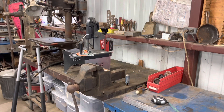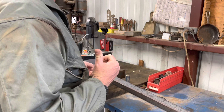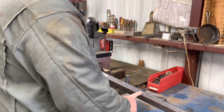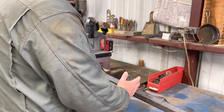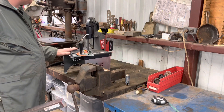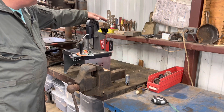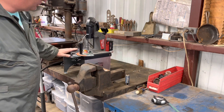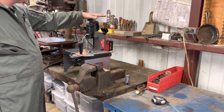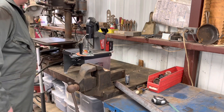To make my shelf, I need to cut the angle iron at 13 inches, because it's a 13-inch toolbox with a 2-inch angle iron on the trailer I'm going to weld into. That will give me 11 inches underneath the toolbox. To cut it, I'm going to use one of the best tools I have — this is a Milwaukee Fuel M18 cordless portable bandsaw. This mount is by Swag, S-W-A-G, and it's made just to hold this.